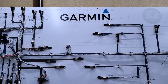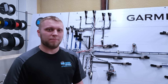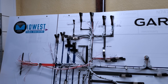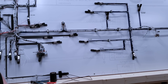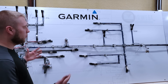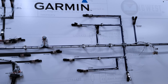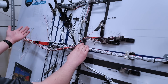When we start any project, the first thing we do is make our wiring diagrams, engineer the whole system to make sure everything's going to work, and then we just build it. This one here is about 90% to completion. This harness board essentially mimics what would be a Sling TSI aircraft, so you can look at it and get an idea of where everything's going to be in the airplane. This junction right here covers everything behind the instrument panel and also on our LRU rack.